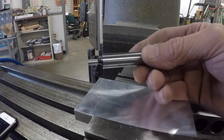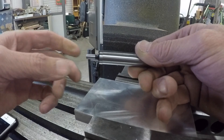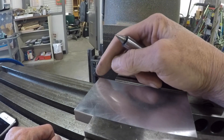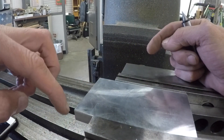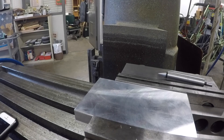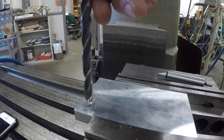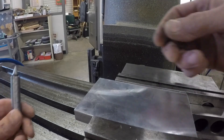I want to clear some stuff up, because the video I had for this that I wanted to upload a couple weeks ago got corrupted, unfortunately. I want to clear up how to find an edge, and if you find two edges, we can find the corner. So let's say we have a hole we want to drill that's a half inch from this edge and a half inch from that edge — five hundred thousandths — we can drill a hole exactly at five hundred thousandths. The way we have to do that is by finding this edge.